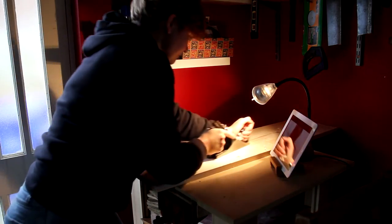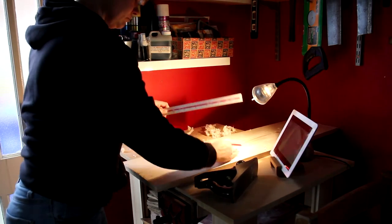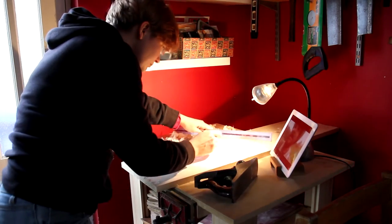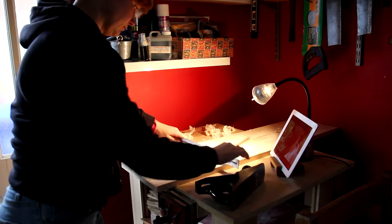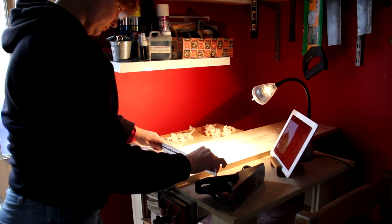The timber was fairly cupped on one side and convex on the other, but because it was thicker than the other timber I'm matching it to, it was no trouble to plane it until it was flat, and that would actually make it the same thickness as the other timber, or at least close to, and reduce the weight as well of the final product.